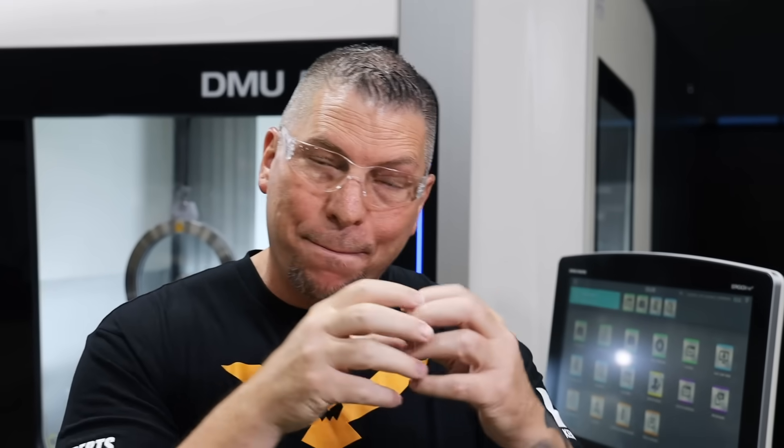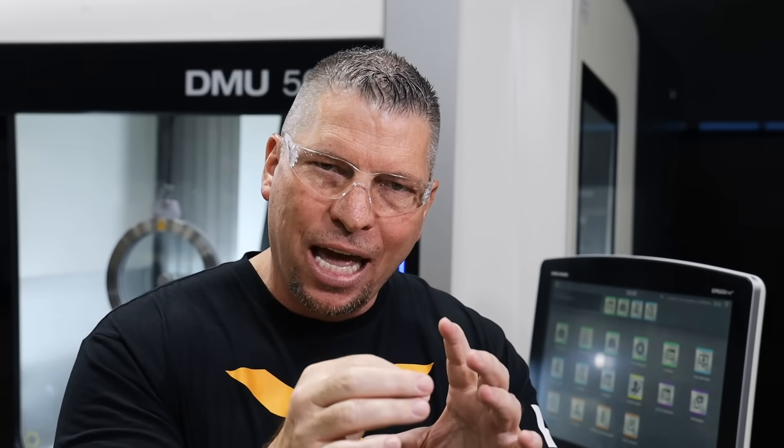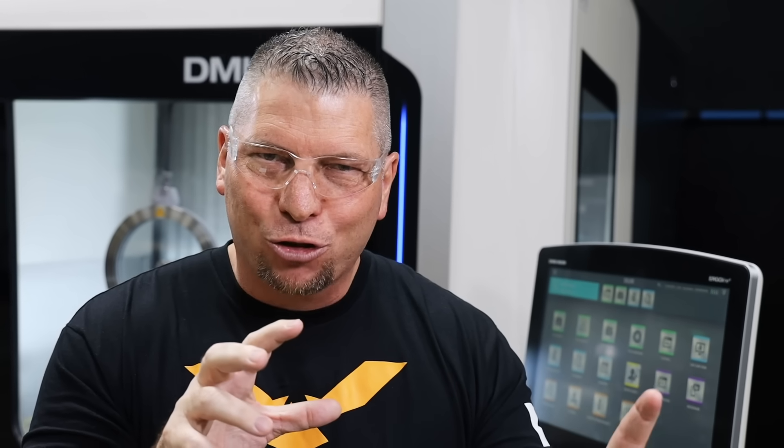What is K500? What they do is take the 400, melt it, add in aluminum and titanium, and then heat it for about a day and a half. It goes to 1200 degrees for 16 hours, then drops down to around 1000 degrees for another eight hours. During that process, the aluminum and titanium distribute and crystallize around the grain structure, which creates the hardness and strength in the material.